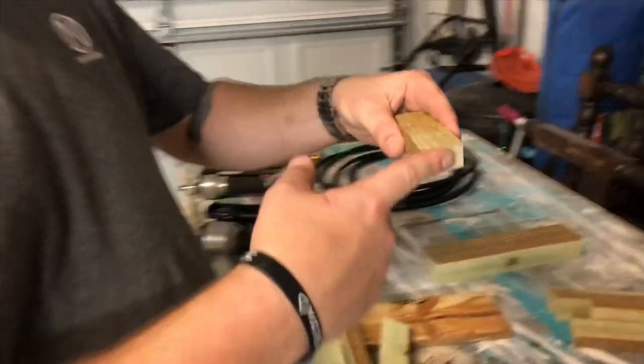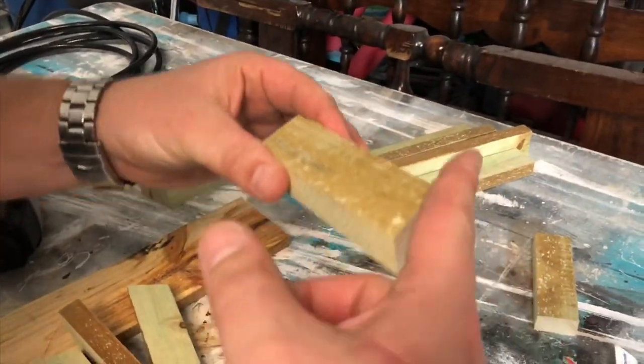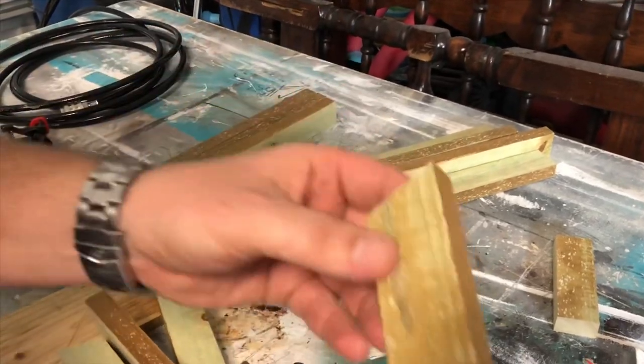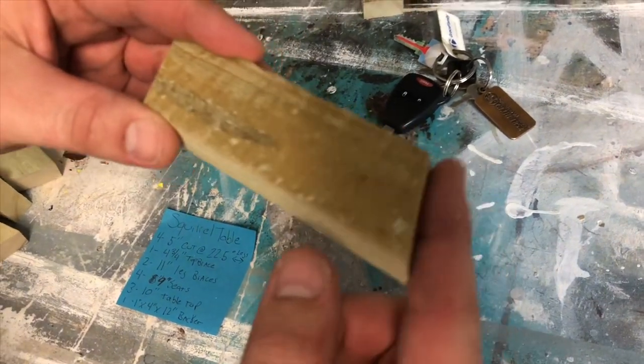Like I said, it's gonna be 22.5 degrees from the corner back. Flip it, put that side against your fence, 22 degrees from that corner back. If you're using the rounded furring strips that you get, you're gonna need to switch your miter back. So I'll show you what I mean here in a second. Now, we're done with that.